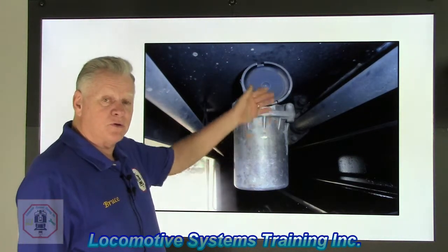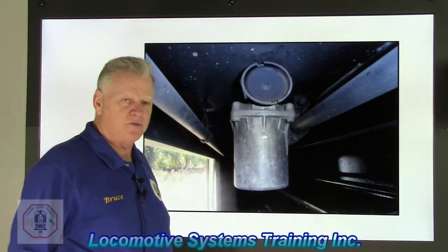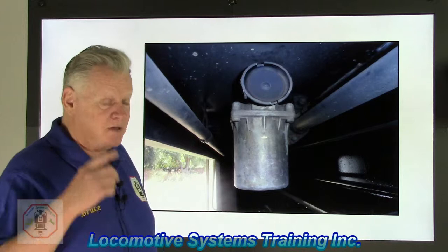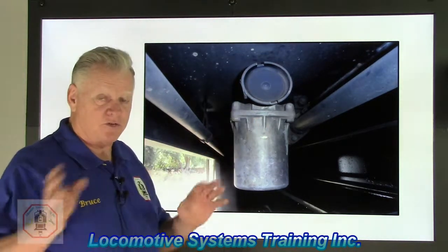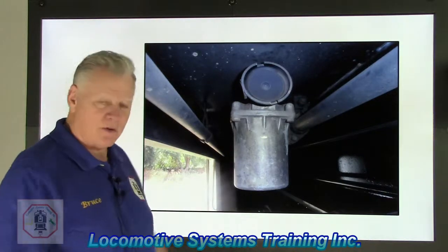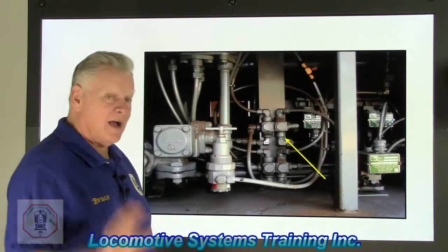All this guy cares about, he breathes. As brake pipe is reduced at a service or penalty rate, this diaphragm moves up and down and just breathes. But if brake pipe is sensed at an emergency rate, then each one of these lights off in a serial action. Number 8 vent valve. Get rid of that brake pipe right now. Okay, boom, next one.